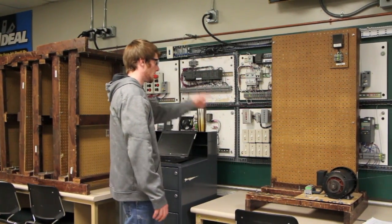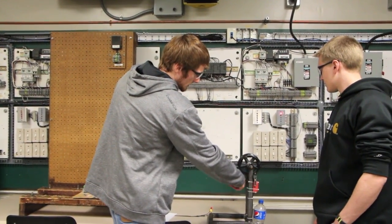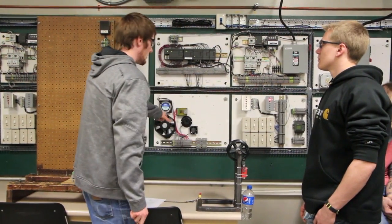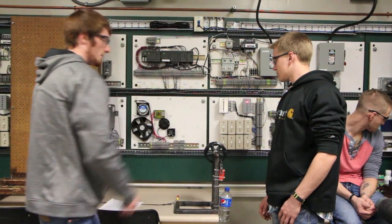The forward and reverse overrides the jigging. Then what's going to happen is we have a red button, and as soon as the limit switch gets hit, it'll turn the green LED on, the alarm will sound to warn you that you have a fish on, and then it'll start reeling the line back up until it gets to the top and stops.